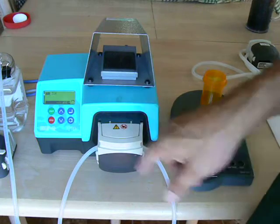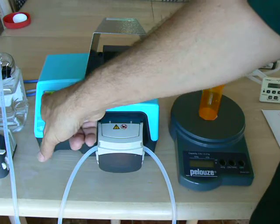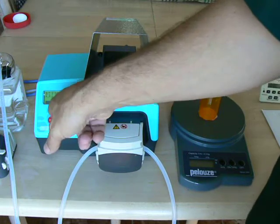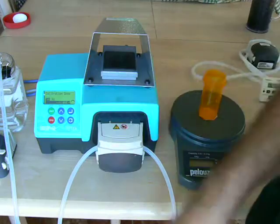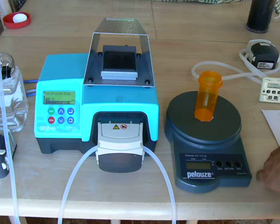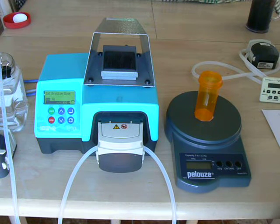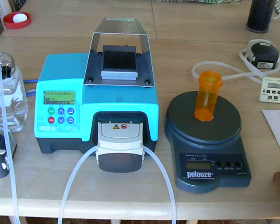It asks which tubing — you navigate through the tubing sizes by millimeter ID. We know we're at 3.2 millimeter ID, we navigate to that and hit Enter. It asks if we want to do a calibration dose — we do. You should do a calibration dose at the same RPM you're going to do the fill. You also want to do a calibration dose at the highest volume you can comfortably measure. If we're targeting a 25 or 30 mil dose, calibrate a volume higher than that, because any error will be multiplied at a larger dose. When you correct that and go back to your smaller dose, it becomes more accurate.